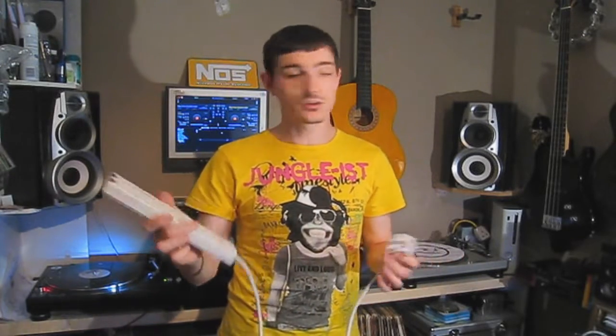What people tend to do is plug one extension lead in, then plug another one into that one, another one into that one, and end up with five of these in a row — loads of plugs all into one lead. What you want to try and do is spread them out. If you've got maybe 10 plugs and one double socket, rather than chaining leads, try plugging two leads into both sockets. It's a bit safer and you won't overload the first extension lead.